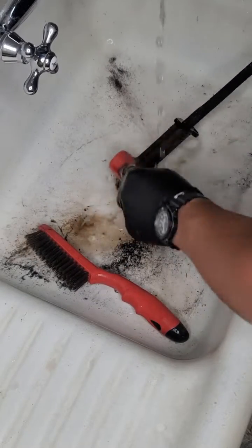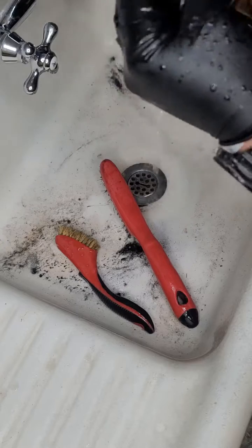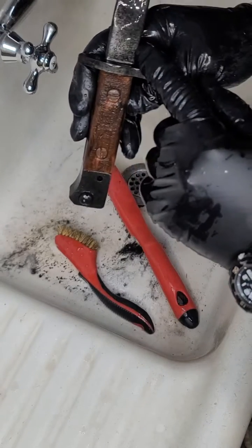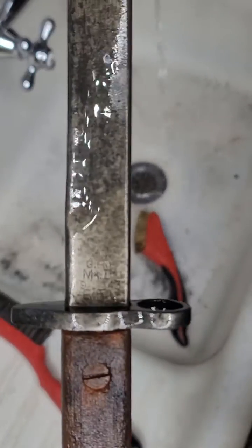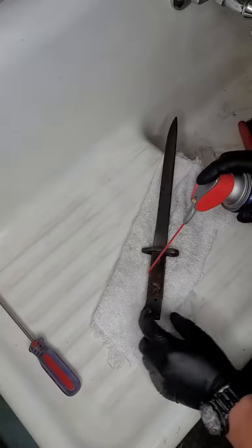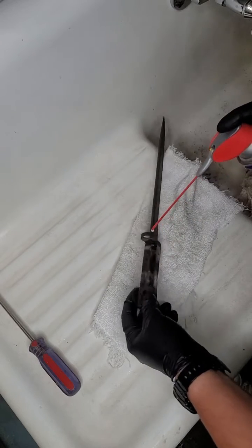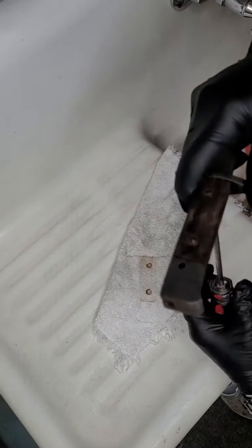Use some gloves and remove the excess material with some brushes. I have a piece of wood on the handle so I may end up replacing that, but you start seeing all the detail of the blade as you start cleaning it. Remember that you don't want to subject your piece to a lot of banging or heavy force. If you have flat screws and other elements, put a little bit of lubricant on them so you can move those pieces and remove them properly for reuse.